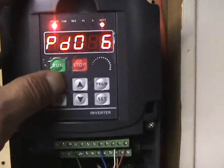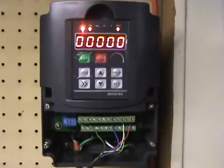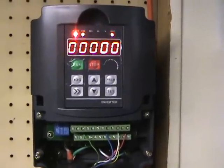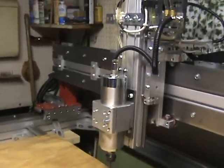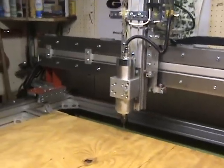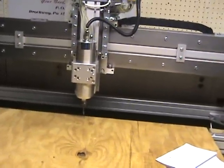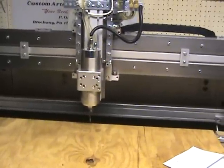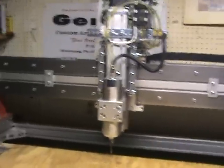It's really not that hard to do — just play around with it a little bit before you hook your spindle in. The settings I showed make it pretty easy. If you have a 2.2 kW Chinese spindle like I do and you follow that setup sheet for the parameter inputs, you'll get everything basically working properly — you'll have the proper RPM displays and so forth. If anybody has any questions please post and I'll do my best to answer them. Thanks for watching.